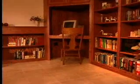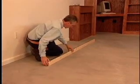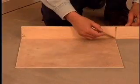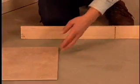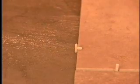We will now look at the steps to follow when installing DuraCeramic with grout. Layout of the floor is slightly different for grouted jobs because you must add the thickness of the grout spacing between the tiles when marking and measuring your tile placement. The spacing between the tiles can be from 1/16 to 1/4 of an inch, depending upon the desired grout width. It is helpful to snap additional chalk lines to keep the joints straight.